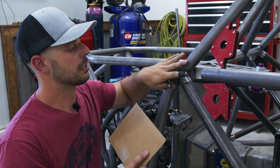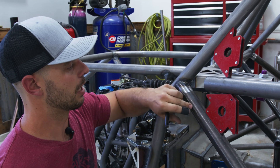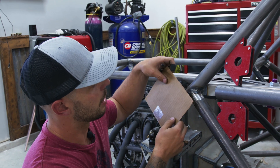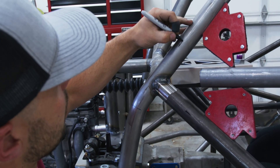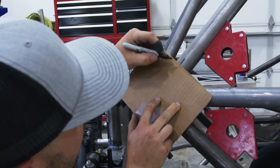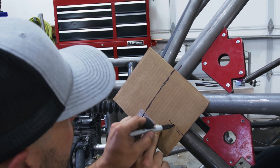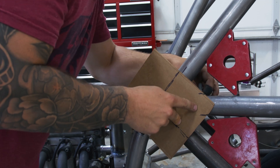I'm going to grab some cardboard. We're going to start doing that initial cardboard to CAD phase where we get the overall shapes so we can take it back to CAD knowing where the geometry needs to be and design these parts. So now we're in the hinge area — let's start with this first. I want to gusset this area and it's going to be dual purpose: good strength in this corner, but we're also going to keep a big U-shape out of it, and within that U-shape we're going to have that bushed hinge in there. So let's mark our center lines and hold it up to where we like the two coming together here. We're going to have this U-shape here.